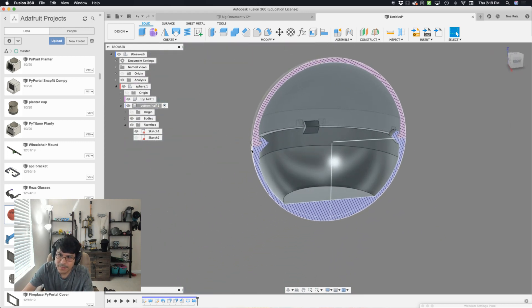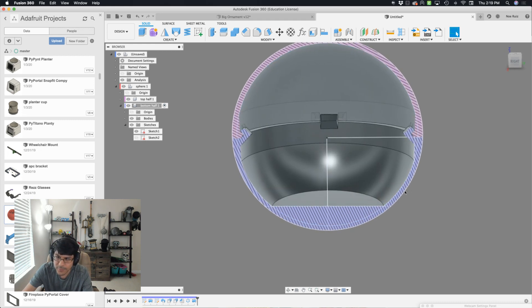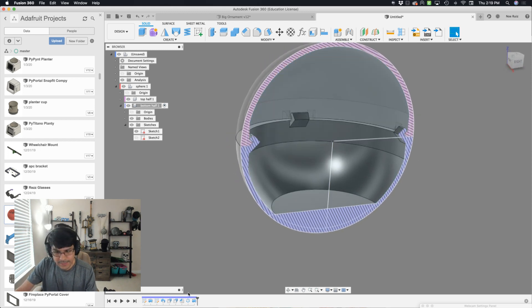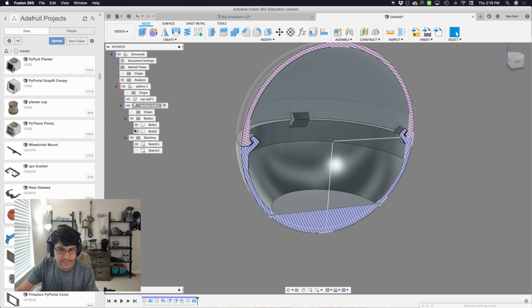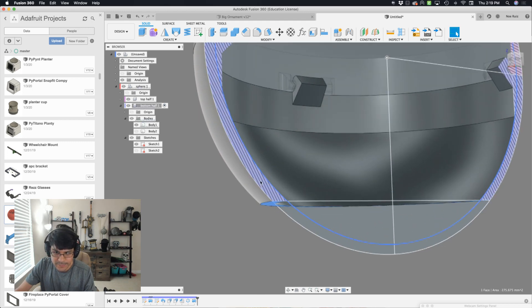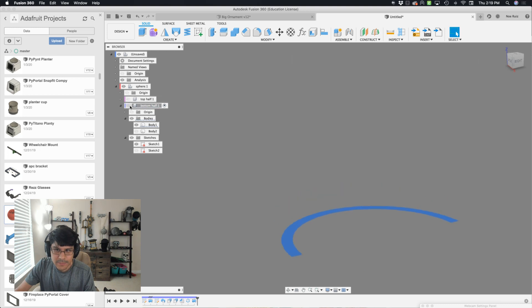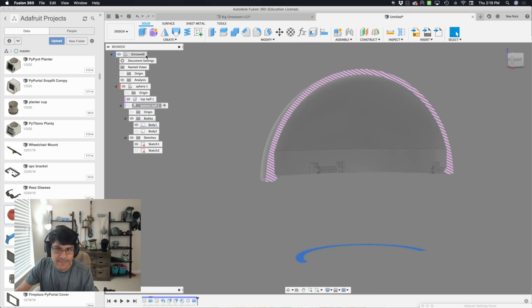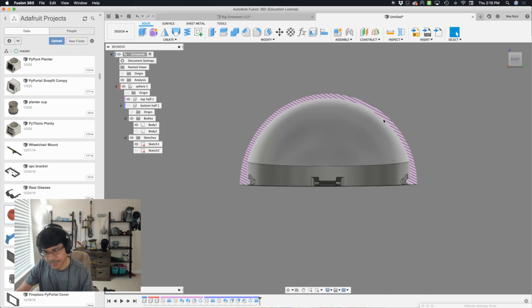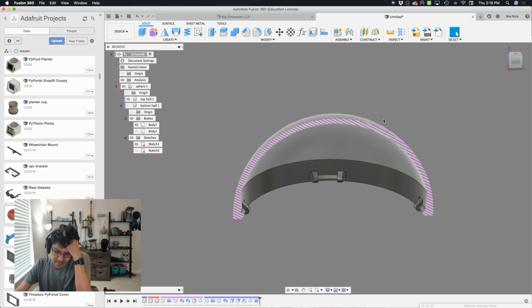So the last thing we can do is test out our user parameters to see if it will actually scale. Let's pull up the user parameter window. Let's add 10 to the diameter — so 70. That didn't break. 80, 90 — how about 300 millimeters? Now you can see our snaps need to get bigger, so let's bring snaps up to 8, then 10. Our thickness is starting to look small too — let's double it to 3. It's all working. Want more gap? Try 0.4, or even 1 millimeter gap — now it's really loosey-goosey. So would this actually work? Yes — I've already done it.